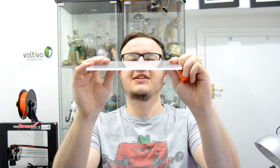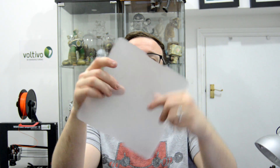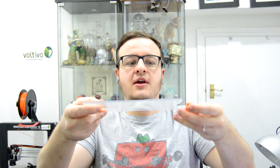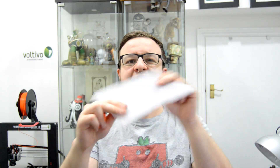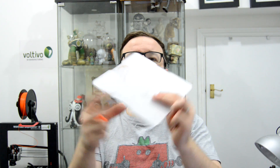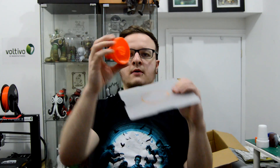It hasn't actually warped the plate much — there's a tiny little bend in it, but that might just be from where I'm flexing it while it's still warm. The clips hold it down nice and flat. I'll pop a link in the description to my Thingiverse file for these little clips if you need them. Obviously if your build plate only moves up and down with lots of space either side, the bulldog clips that came with it won't be a problem. I'm not quite sure what material this is — maybe sanded acrylic or something like that — but it works really well. It's got a nice strength and flex to it, and the whole point is to flex it without needing a paint scraper. It's actually strangely satisfying to hear the crack and have prints pop straight off.